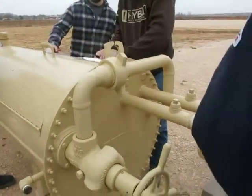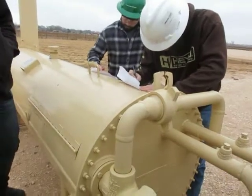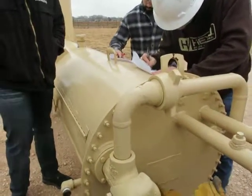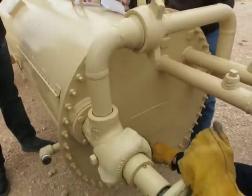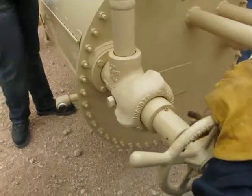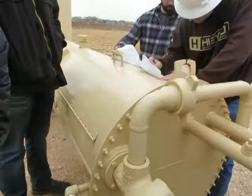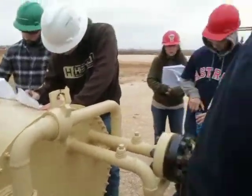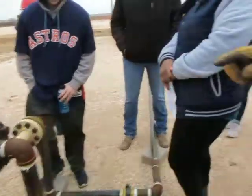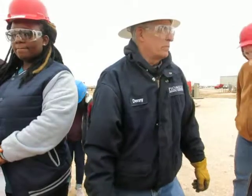And all those things you calculated, the square footage required, the pressure it had to withstand. The second coils are only 2-inch X heavy, and those have an area of about 32.3 square feet. They're rated to 3,440 PSI. So in the line heater, what's important is what those tubes can take inside where you're passing the gas.